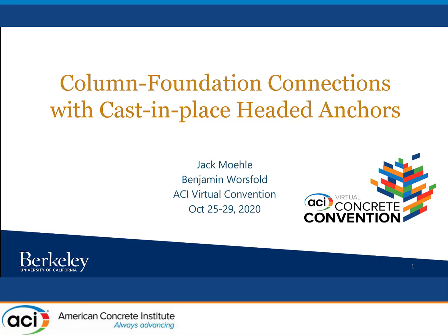But mainly this was a question that was asked by engineers designing steel buildings that were connected to concrete foundations. And so the real problem became one of column to foundation connections with cast in place headed anchors, and they're really anchor bolts.